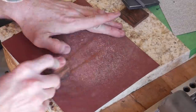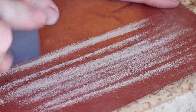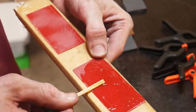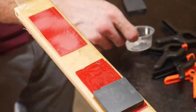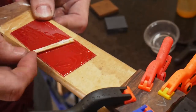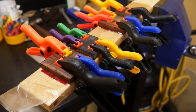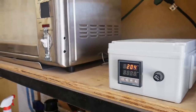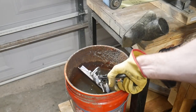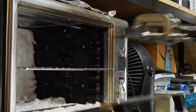You may have noticed that I added some heat shield to the front of my tempering oven. Surprisingly enough, this has made a huge difference in how fast my oven heats up and how easily it stays at temperature. Using my granite surface plate and some sandpaper, I get all of the pieces for my handle material flat, and then we will be using some G10 spacer material as a base for our pieces. The front of the handle scales will be ebony and the back will be ironwood. In between tempering cycles, I cool off the blade to room temperature quickly in water and then get back to tempering.